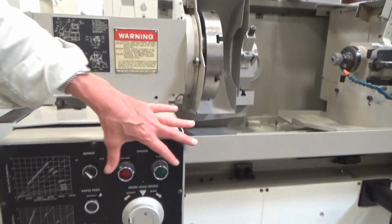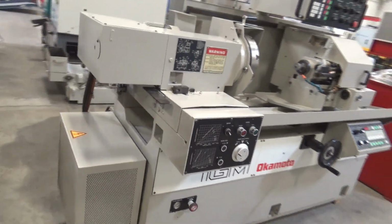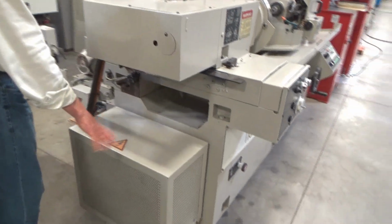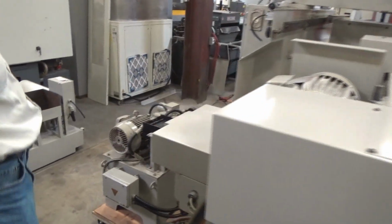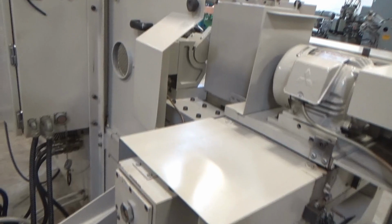Right up above that is chuck, unchuck for the chuck. And this thing goes either way on the power input. Right now, this thing has a 480 to 220 transformer, so we're bringing 480 to it as it stands. Work head motor up high, and incremental servo. There's the servo motor down low.